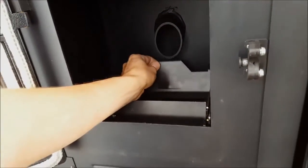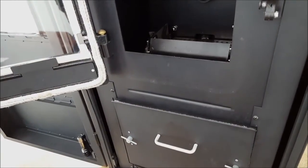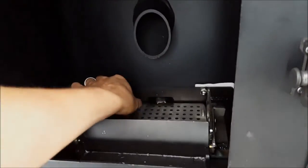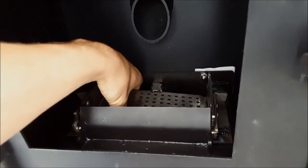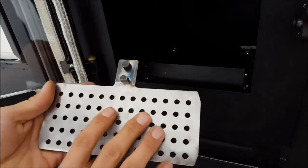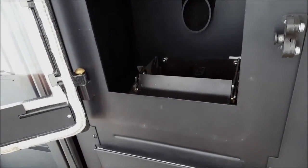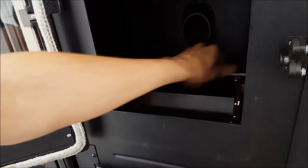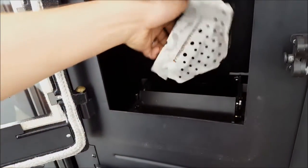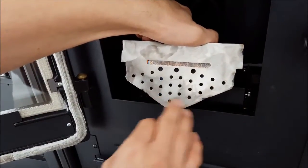Next, we're going to remove the burn pot. Inspect the pieces and clean them as you remove them. Ensuring all the portholes on all the components are nice and clean. Should there be too much debris buildup inside of the ports, this could, in turn, cause those components to overheat, which is going to reduce the lifetime of those individual pieces.